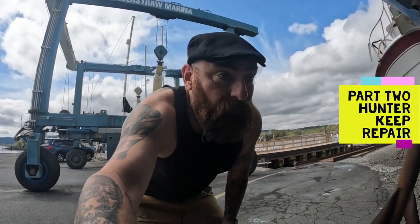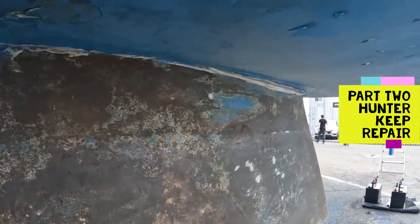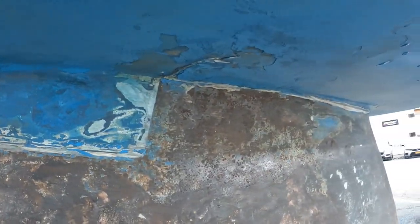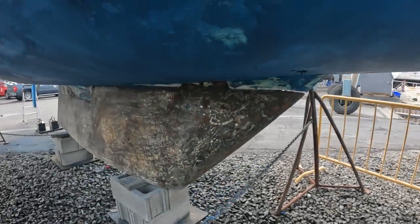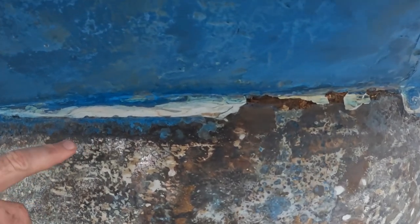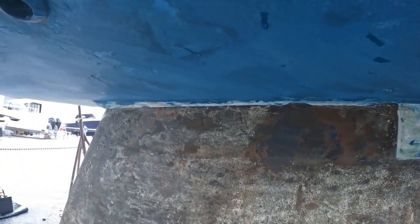The keel has been ground down and all that nasty fairing compound has been pulled out. We need to do a little bit of work up here — pick this out and re-handle it. I'd like to pull some of this down; that still needs to be ground out. I'll fill in the joint up here. Where I thought it was really bad, I'm just going to get some 5200 in there. All that delamination has been removed, and you can see the keel joint — a little bit of rust, but he's doing some more grinding today. This joint is good; this side is actually better than I thought.